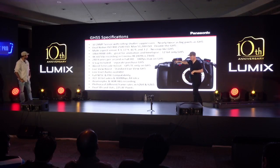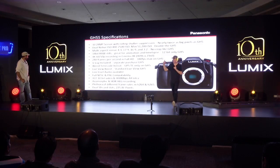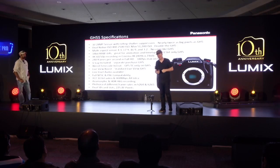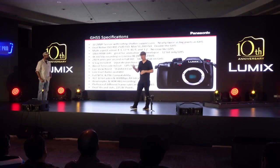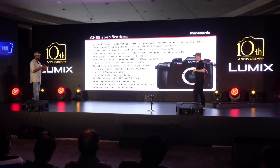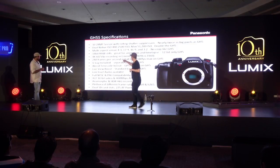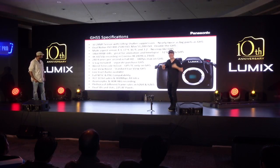And now I'm going to run through some of these really quickly. We've also got a wired timecode in/out. This port here comes off, and then a BNC cable attachment adapter. So you've got real timecode sync locking, jamming as we call it, between a multi-camera setup or a clock driver in a master-slave scenario. You'd probably use that in broadcasting. Oh yeah, it's very good to sync two, three cameras together, especially when you're doing interviews and live stuff. Exactly. We've also got a live view boost, 120 frames per second, the screen's flying around, so you see everything as it happens.